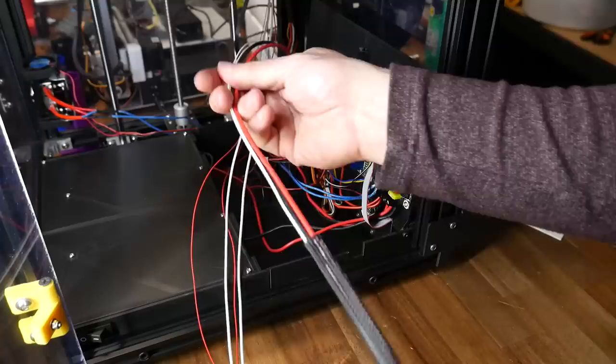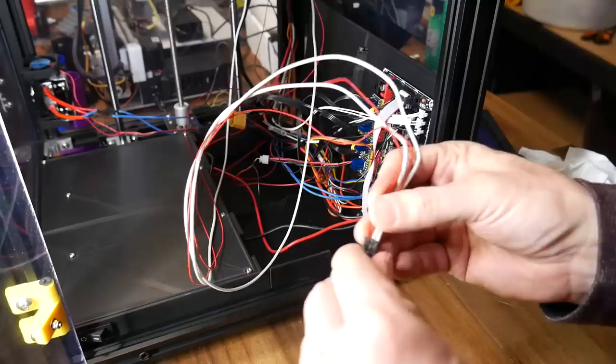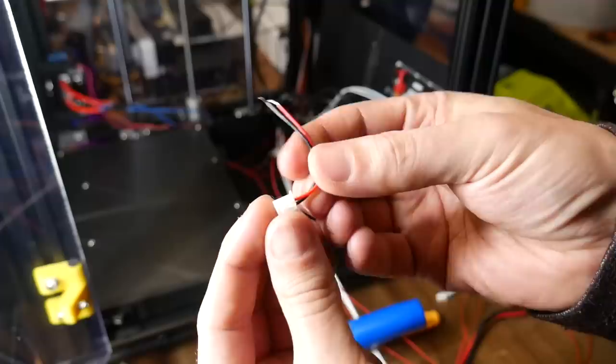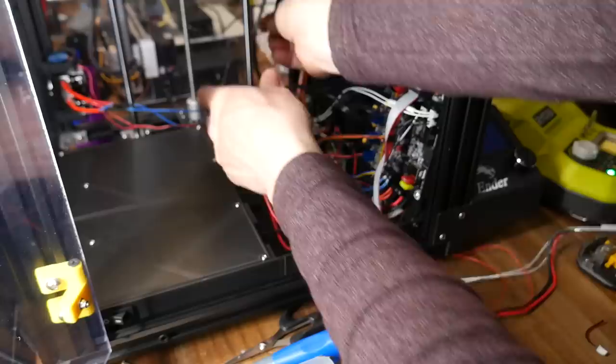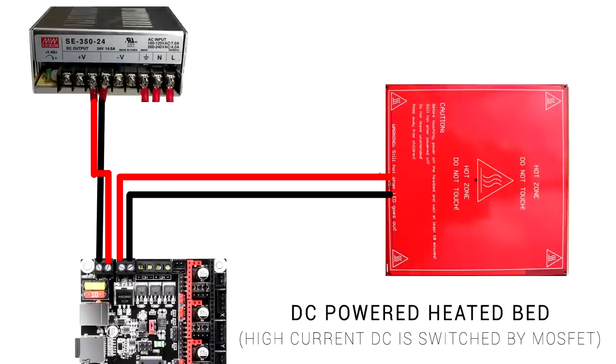Next up, we need to wire up our new heater. I started by removing the old wiring, sliding off the protective sheathing because I wanted to reuse it on the new heater cables. The old heated bed cables simply unscrew from the terminal block, and the thermistor unplugs from the corner of the mainboard. I took the heater and thermistor wires for the new silicon bed and fed the sheathing back over them to protect them. Rather than cutting the plug off the old thermistor, I took a JST plug from an old busted fan and soldered that onto the end. Polarity isn't important here, so you can ignore the red and black wires when you plug it in.